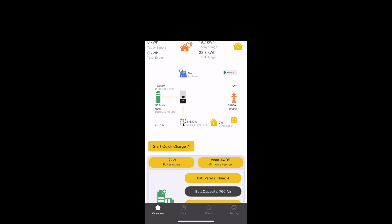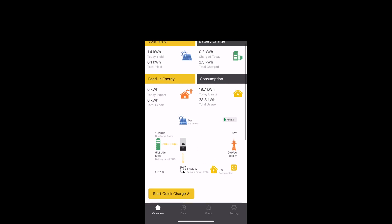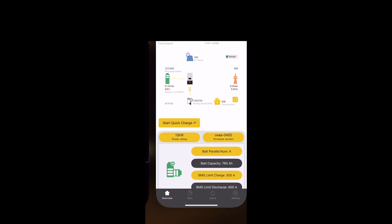According to the app, we're pushing about 11,600 watts out of the 12000XP into our load center. The load center currently has four batteries connected in parallel. The battery capacity for the two indoor wall mount units plus two 100 amp-hour batteries is about 760 amp-hours. The wattage coming out of each line is close to about 5,800 watts, and it's been pushing power out very steadily.